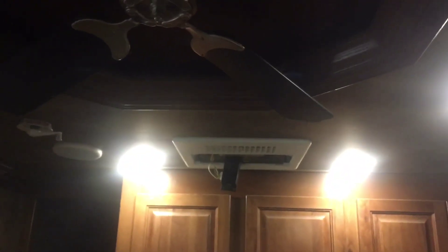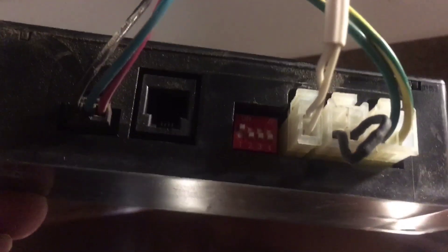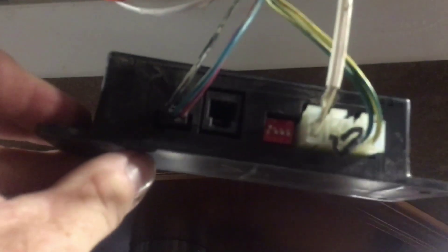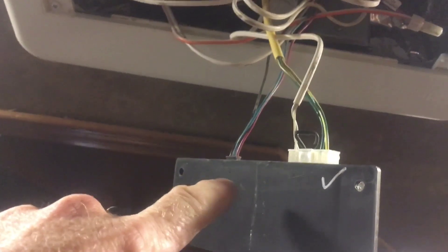In order to figure out what's going on, I took the gateway from the front air conditioner and put it in the rear air conditioner, and took the rear air conditioner gateway and put it in the front. Then I reset the toggle switches to what they should be - this one is position number two and that one is position number one. After redoing the toggle switches, it still has the problem of no air conditioning or heat. That tells me the problem is not between down there and the front stuff, but between here and up there.